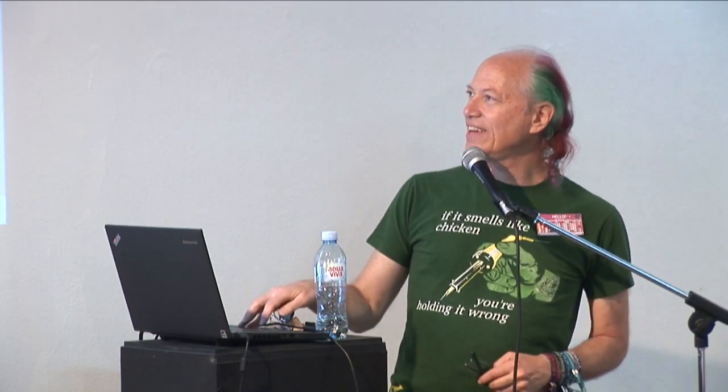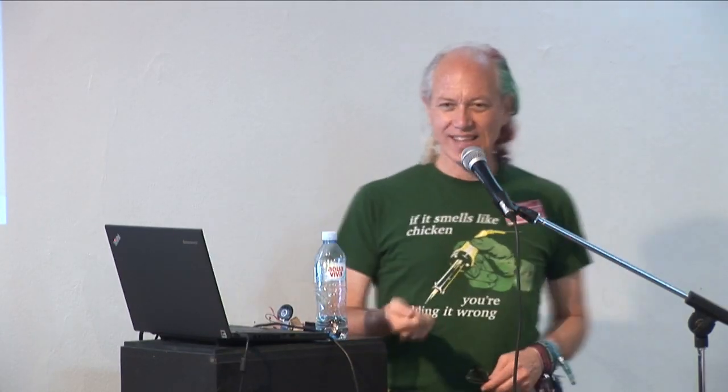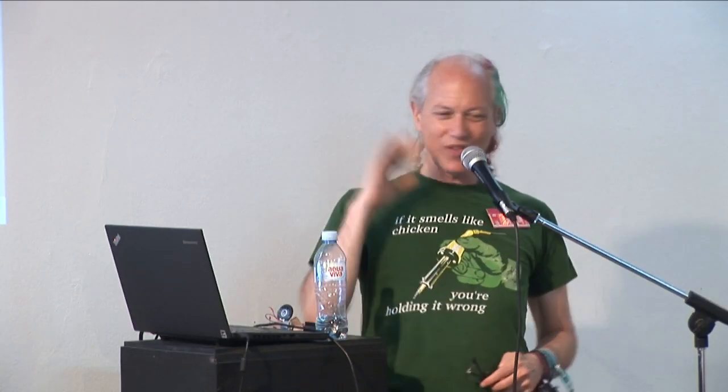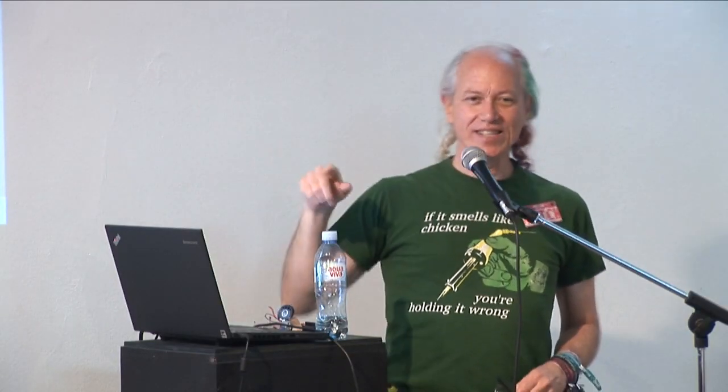Okay? So another weird thing with programming is we can, let me highlight that, we can have what's called a definition. And that's done so that people reading your program have an easier time of it. Or if you, three weeks later, after writing your program, come back to it and want to figure out what you were thinking about and what your program does, it makes it easier on you too. So this line here says int LED equals 13. That just means whenever later in the program, further down, anytime you see the letter combination LED, replace that with the number 13. So for instance, here it says LED. Just replace that with the number 13 in your mind, because that's what the Arduino software is going to do.